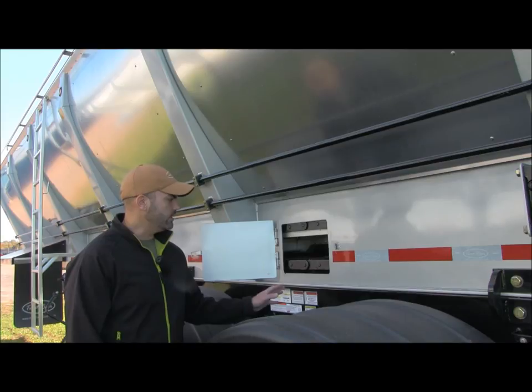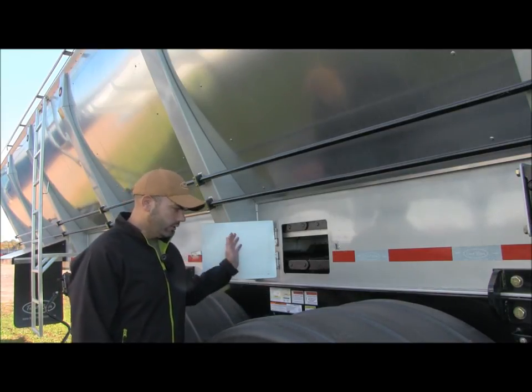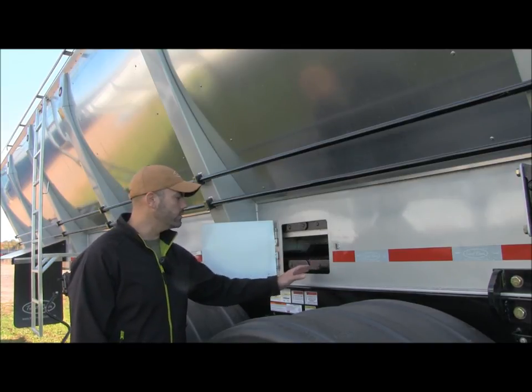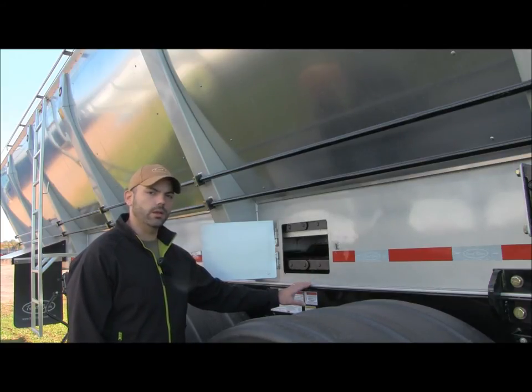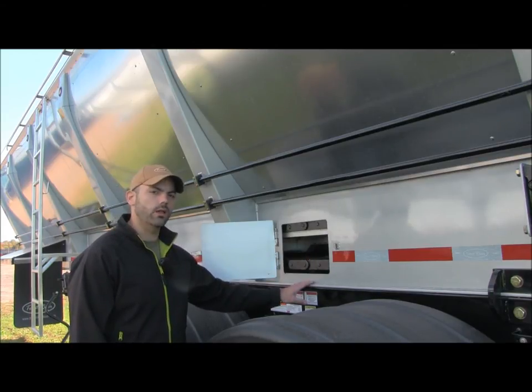Once you do this and it's clean, you're going to want to make sure you give this a very heavy-duty oiling. Turn your oiler on at the front, let it run, and make sure the oil is getting all soaked into the chain. I would also recommend getting a good quality open gear lubricant and spray the chain down at the inspection door as well. You just want to make sure you get enough oil in there to work all the water out.